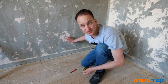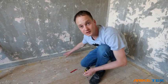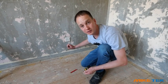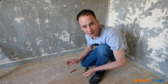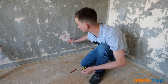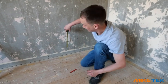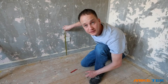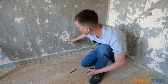If you want to change the height of the sockets — make them lower or higher — by all means, but you need to consider the skirting board. If your skirting board comes up close underneath the socket, you don't want the socket touching it because when you put a plug in it might catch the skirting and you won't be able to use your electrics. Always be mindful: if you know the height of your skirting, leave two or three inches for the socket to go above it. Or if you want to match other rooms in the house, go and measure from the floor up to the screws. In this case we've got 350 millimetres, so I'm going to pencil 350 millimetres and that is the centre of the socket.